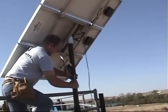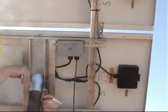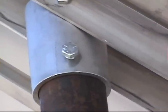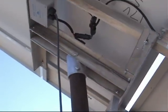This particular kit includes our ALC, which is our electronic water level cutoff. That'll shut the pump off when the tank gets full, and as the cattle take the water away from the sensor by drinking, it'll turn the pump back on once again. This is a three panel kit, what we call our K-255. We're going to tighten the remaining bolts on our wind bracket — we have two set bolts, one on each side, to tighten to our pole, and then a bolt that controls the tilt angle of the panel.